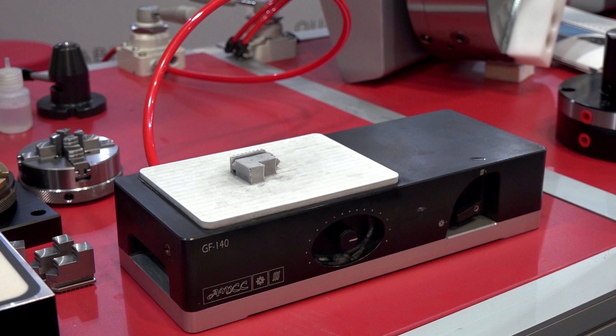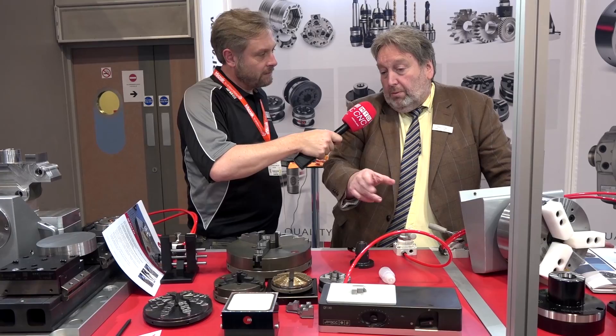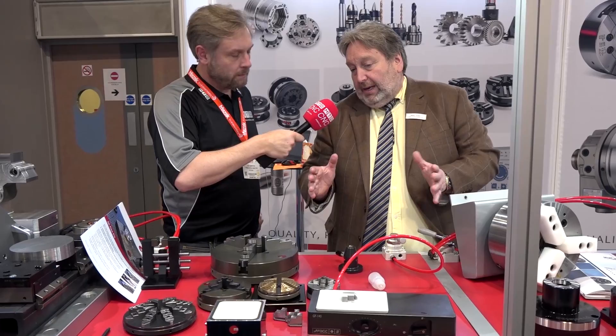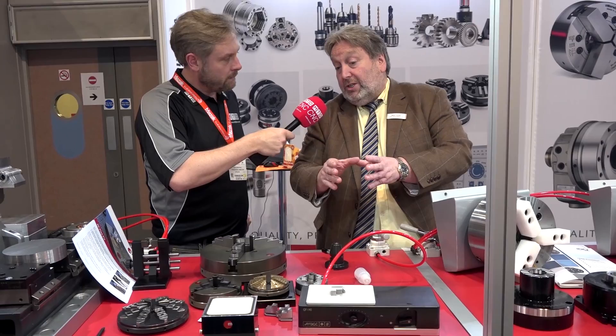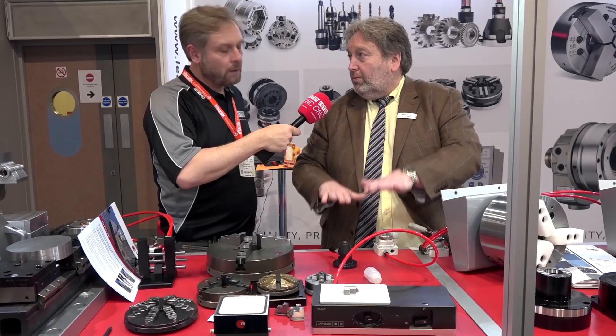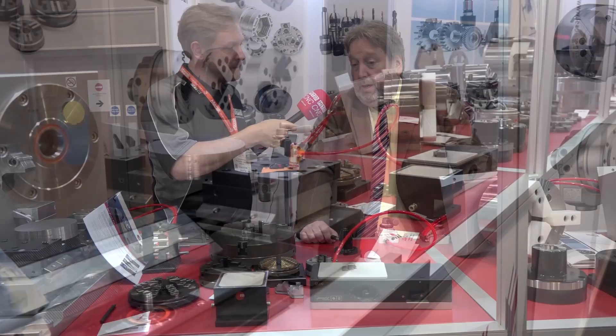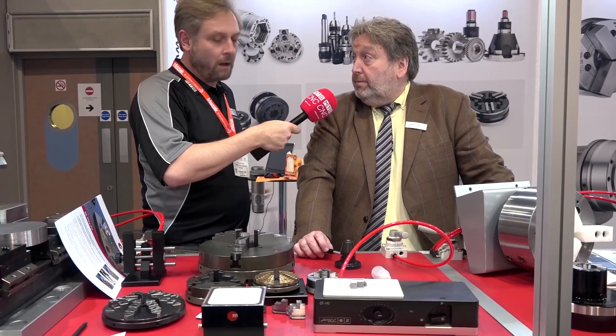What sort of industries and components are you looking to machine on there? Ceramics is a big market for this — people want to hold and grind ceramics. Plastics is the next best industry we sell to. Because it's run on a regular airline, the bigger the table the less efficient the freezing becomes. The biggest plate we do is 250 millimeters. For larger workpieces, we use modular plates — as long as each has an airline feed, they'll all freeze together. It's more aimed at smaller components — horology, for example, and it is sold in numbers in Switzerland.